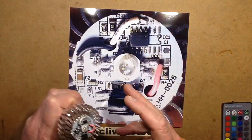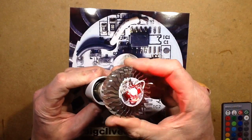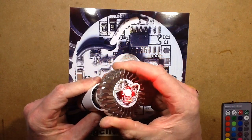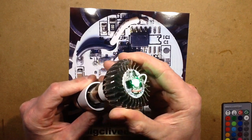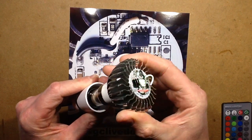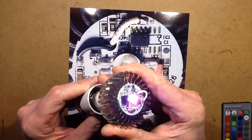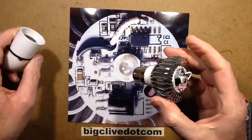The white wire is to monitor the power supply. The voltage on it was approximately 2.5 volts. If you power it up it goes into a fast colour change mode. If you disconnect and power up again it goes into a slower colour change mode. Disconnect again and it stays red; again it stays green; again it stays blue; and again it stays white. So it does have the facility to control it by turning it on and off at the wall switch.